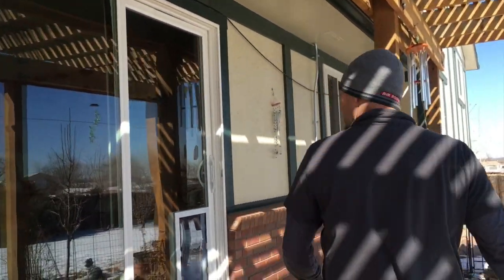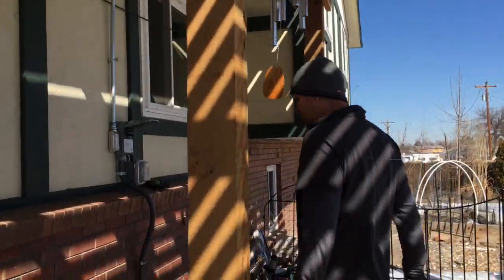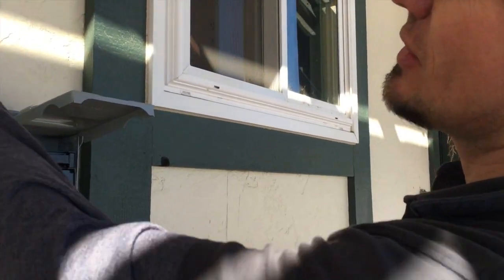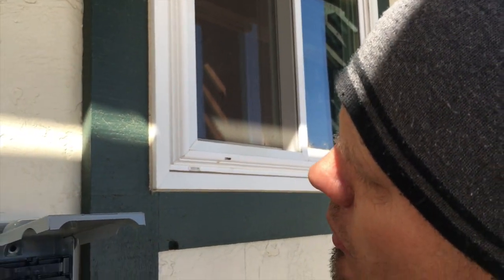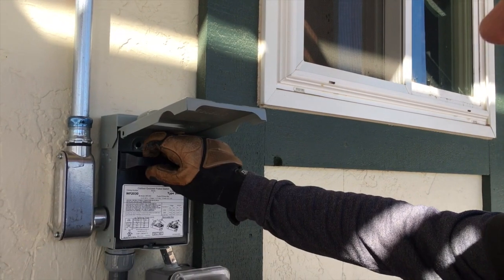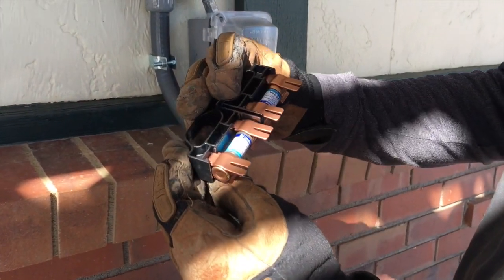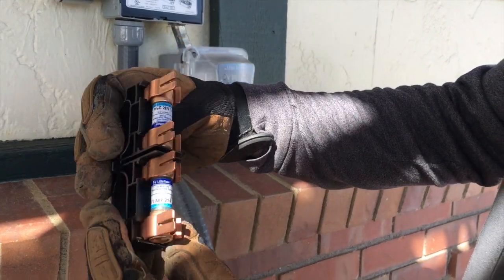In this case they wanted an extra one. The unit is going to get wired up next Monday, so we went ahead and wired this up today. It's in a three-quarter EMT conduit with 10 gauge wire coming in, and it's going to be fused at a 25 amp FRN fuse by Littelfuse.